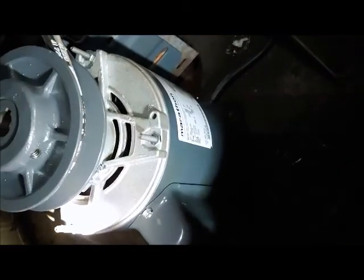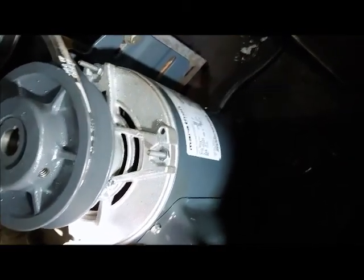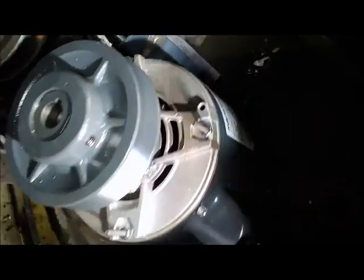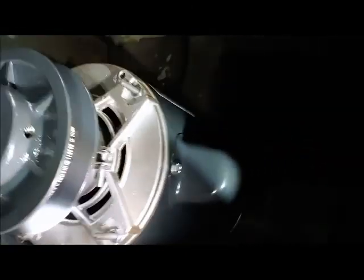This pulley, as I was thinking about it, is actually kind of big, and it was kind of messing with the velocity on the blower. So that's why I got the adjustable one. Got to adjust it in so we get that pulley size a little bit smaller, so we can slow it down a little bit, because I think it was going too much. But it's all walled out there.